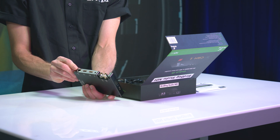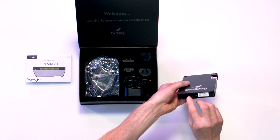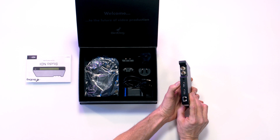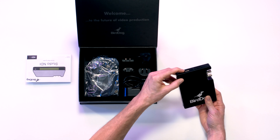There's your Ethernet port, and that also has PoE. So you actually have three power options here: the AC, the DTAP — which is on this end, AC port and DTAP port — or you can use PoE. There's also an external tally port here, and on this side there's USB, which you could use, for example, with a USB to Ethernet adapter to control PTZs.